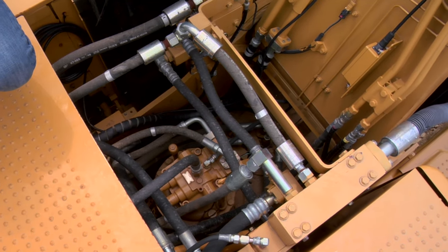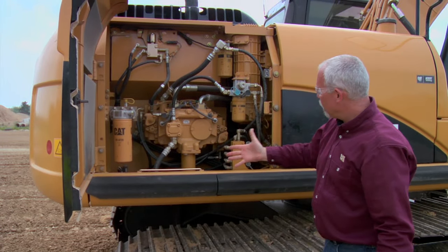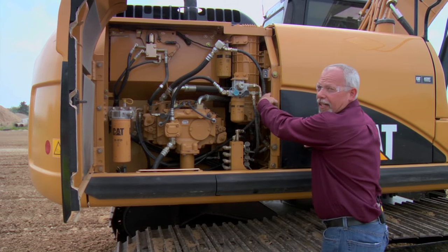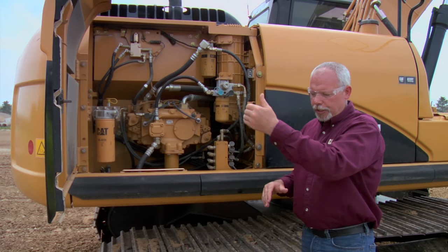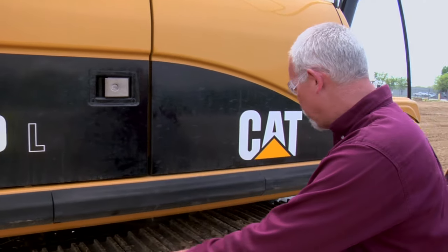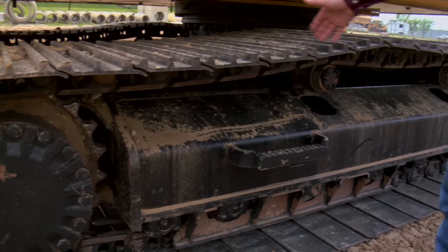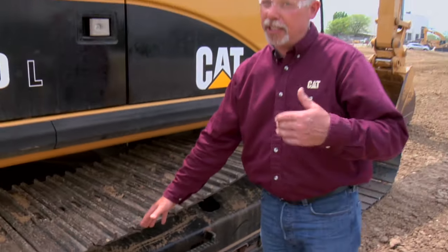Opening up this compartment, I'm giving it a quick visual looking for leaks, and I want to check my hydraulic oil which is right back in here. The machine needs to be in the service position — sitting with the stick straight up and down — to check that oil. Also I want to look at my track out here: look and see if there's any missing bolts, any damage, or defective or bent shoes. One bent shoe can lead to another and another — they just kind of progress from there on out.